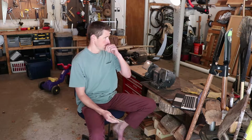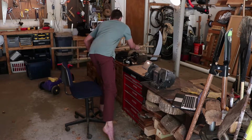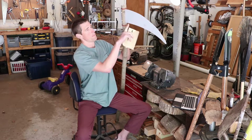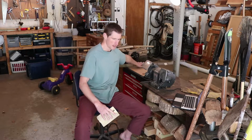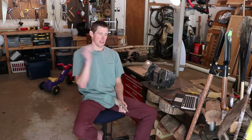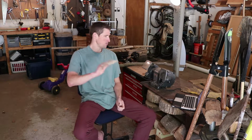So what I did there is something I don't usually do when I'm sharpening things to actually make them sharp. I took a piece of sandpaper and went along the length of the blade. I should have had a knife in my hand right here. Let me see here. Here we go. So imagine this is the lawnmower blade. There's a burr coming off here, a little feathered piece of metal. I was just going like this to smooth out the edge and get rid of that burr. Because when you're on a grinding wheel, it's hard to get a nice smooth motion, so inevitably you're going to have little gouges. So again, take some rough sandpaper. This is 40 grit, 3M. Just smooth that edge down.